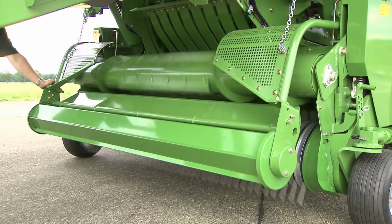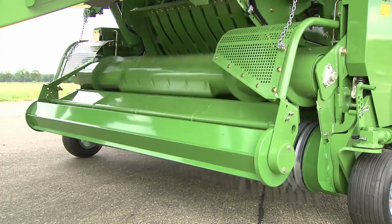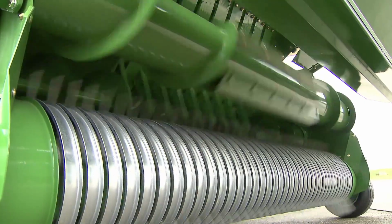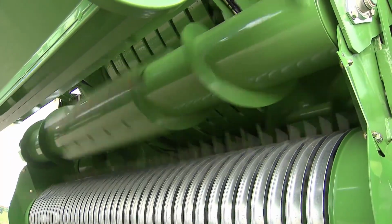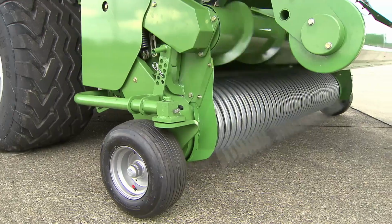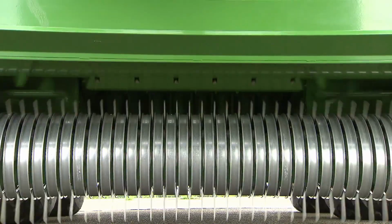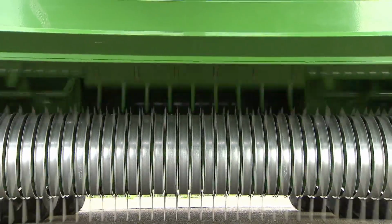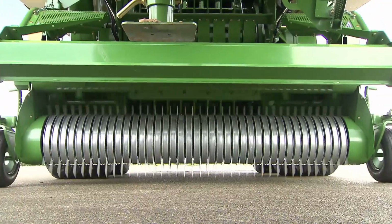The special thing about the active pickup is its open sides, an advantage in wide swathes, and which is achieved by attaching the crop press roller to the top of the feed roller. The EasyFlow pickup offers a work width of 1.95 meters or 2.35 meters, measured to DIN, and has 5 rows of tines which are spaced at 55 millimeters.